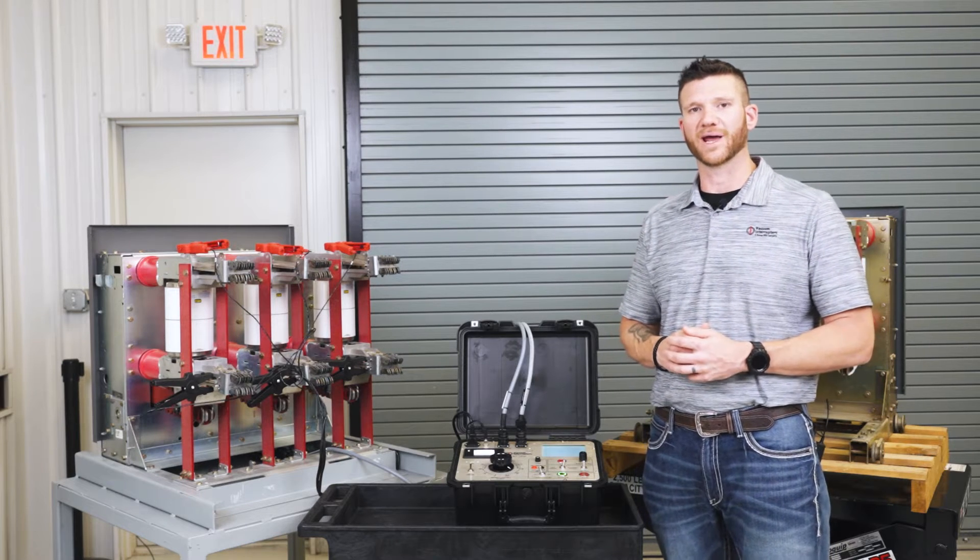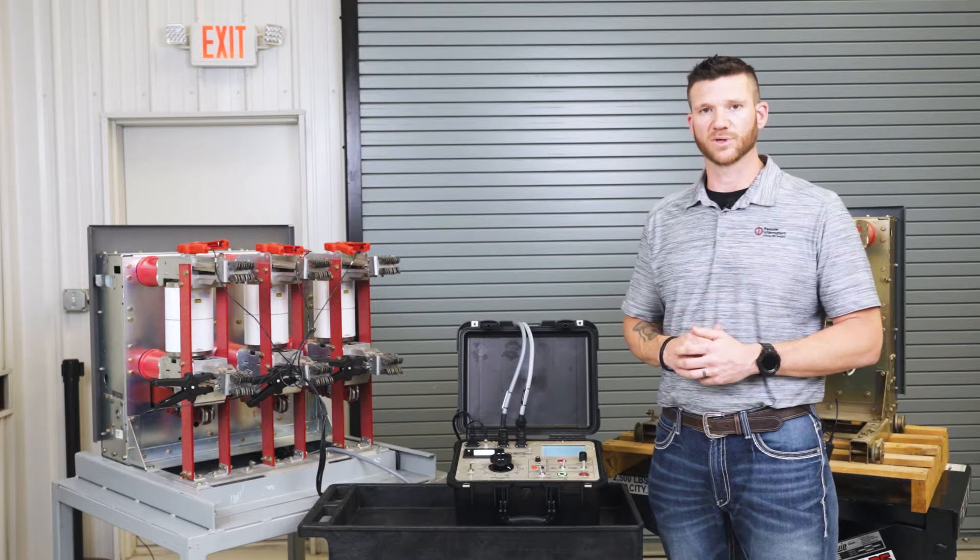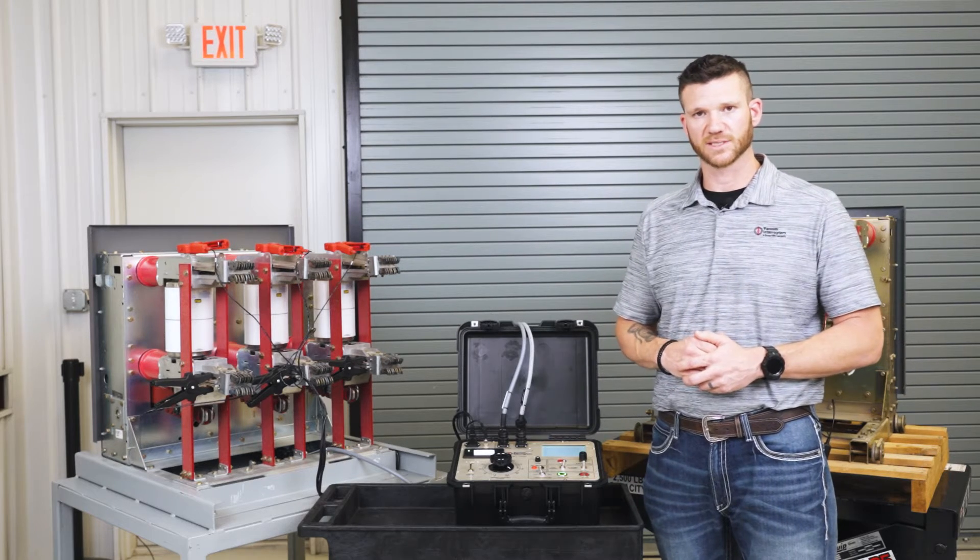With those numbers you can refer to your breaker manual, which will have published data you'll need to compare your results to the manufacturer specs. Some of the things you can find by simply timing the contacts on your breaker include the open and closing speeds of your breaker.